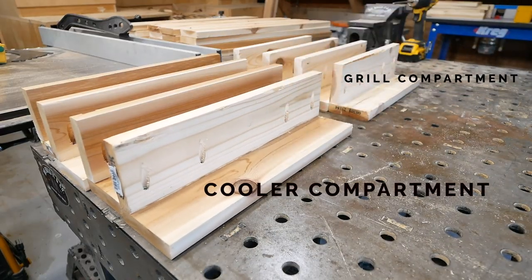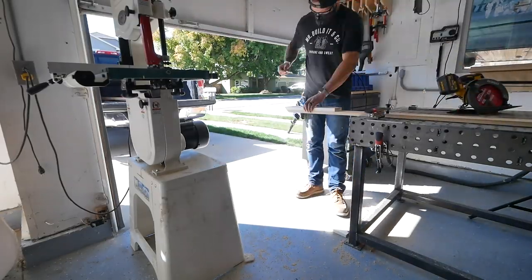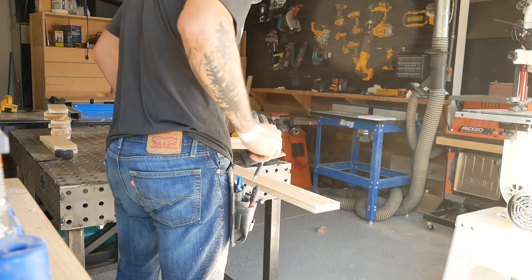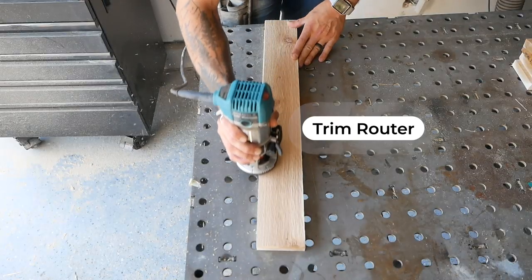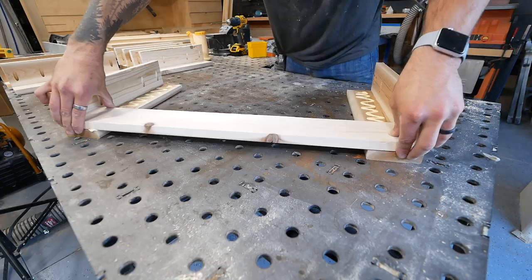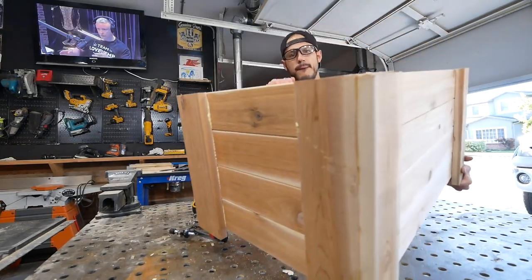Once all the corners were assembled, I started cutting up the panel pieces that create the sides of the cooler. For the width it was 17 and a quarter inches, and for the length it came out to be 27 inches long. Before installing all the side panels, I found that going over all the edges with a 3/8 round-over bit gave it a really nice clean look. Once ready, I used a little bit of wood glue and some 1¼-inch long screws and started assembling each side panel at a time, really watching this project come to life.